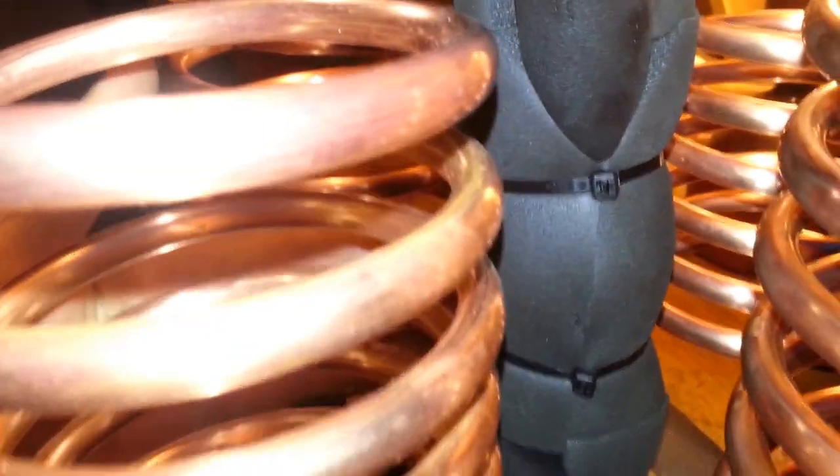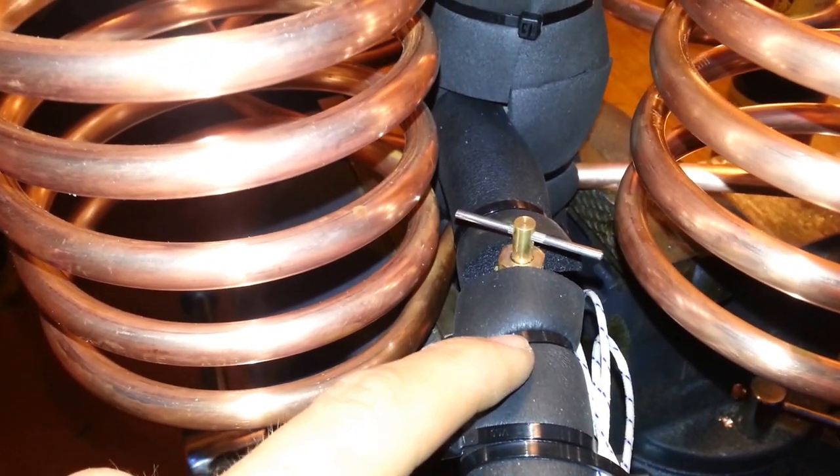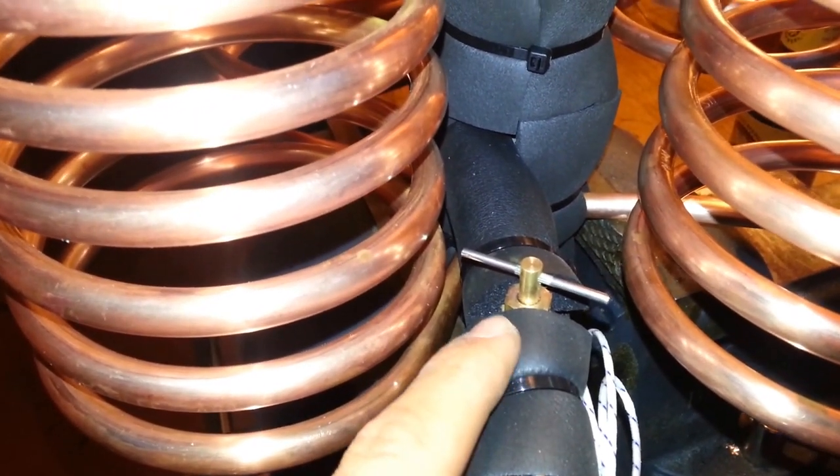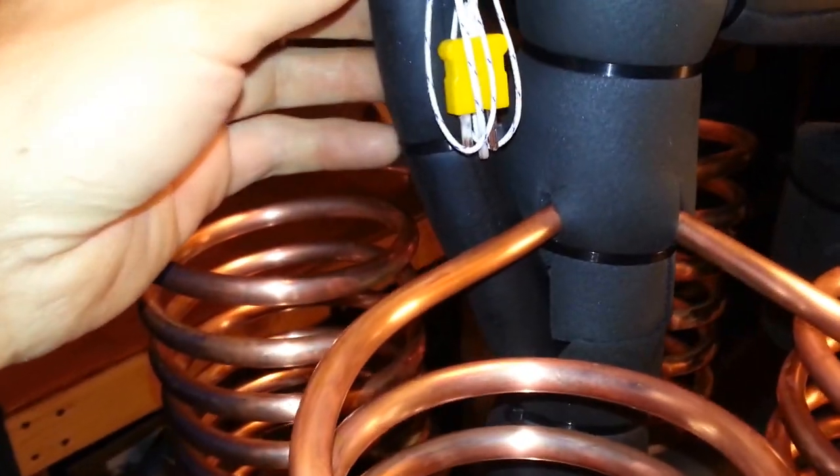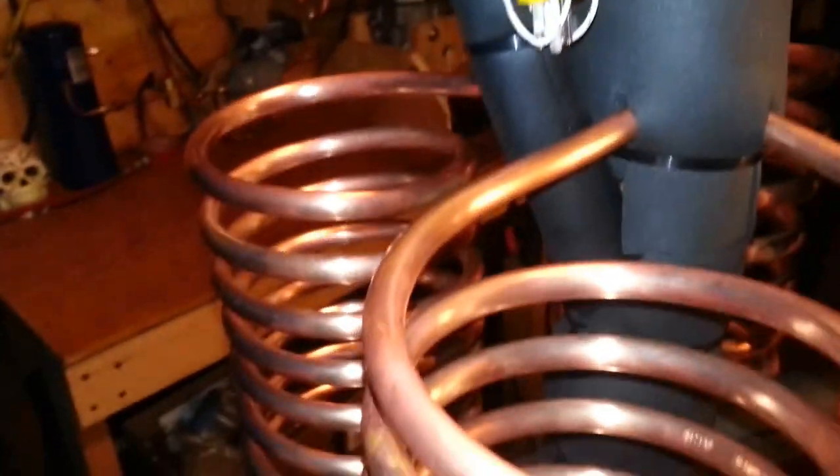You can see there's a line for a thermocouple, and there's one placed about right down here. I didn't want to get too close to the throttling valve because I wanted a decent reading on how much sub-cooling there was after the heat exchanger inside the separator. Additionally, there's another thermocouple up here — this is the hopefully sub-cooled high-pressure liquid being injected through the line before the heat exchanger. The difference between those two values should give me a rough idea of how much additional sub-cooling I'm achieving.